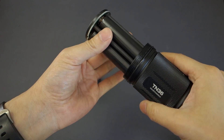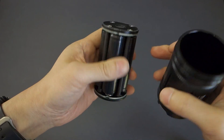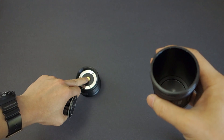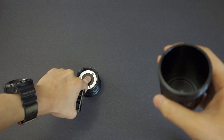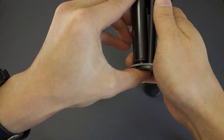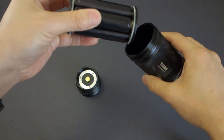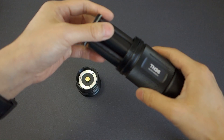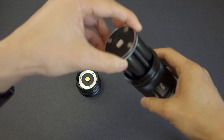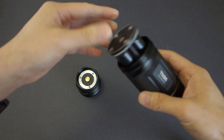The innards are the same and no different than before. It still features a battery carrier with four cells in series and no spring at the bottom — that spring is actually at the head, putting downward pressure on the battery. I have their 3,400 milliamp cells installed. I always put the stickers inward facing; the tube is not incredibly tight, and there is decent clearance room without it being really difficult to insert or remove cells.